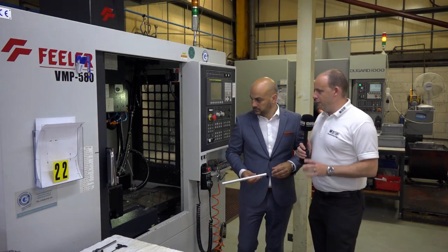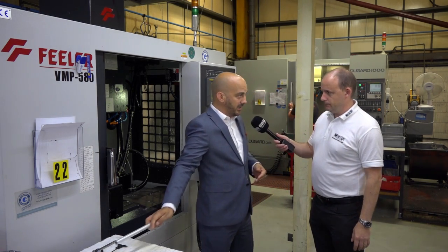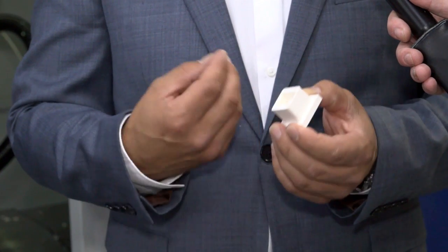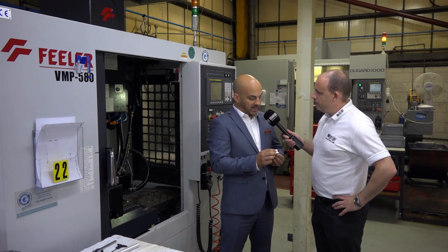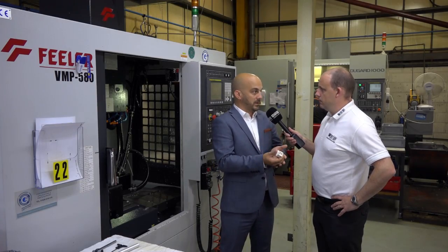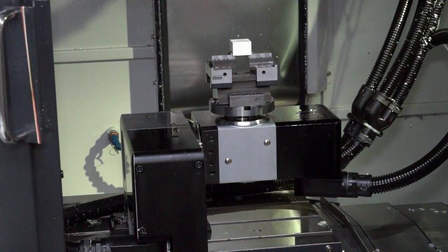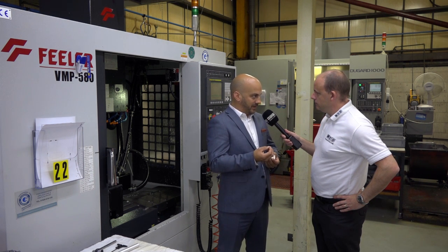I like what you've got here Carl — you've got a fifth axis unit on your Feeler VMC. What are you actually making on here? On here we're making a component for the medical industry. This is a part that we manufacture from engineered plastic. Typically these parts are very low quantity because they're prototype components, and once they're through their approval stages they go to volume. We can now machine these parts competitively using a 3+2. In fact they're not injection moulded — we're machining them complete now. Why did you go for this solution? You've got a full five axis machine essentially, but you've got it using a three axis VMC with a two axis table.